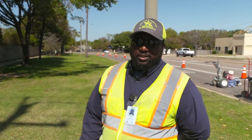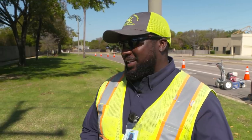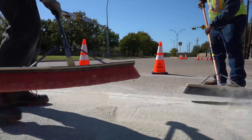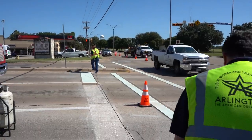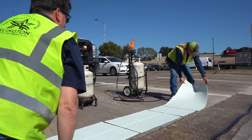Talk to me about how we approach the streets, because in my mind we're out there occasionally just painting and striping — but that's not exactly how it works. It's like a preform. The way it works: we come up to an intersection, grind up the old material, sweep it up, put it in our trash cans, and blow it off with our blower.